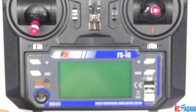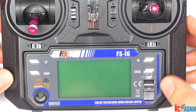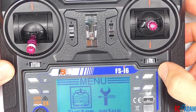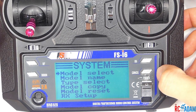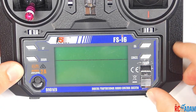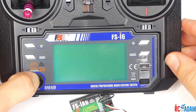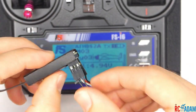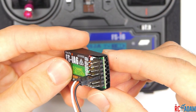With our receiver powered on and in bind mode, we go to our transmitter — this is the i6 model, and this will be the same for the i6x model as well. Power it on with all the switches in the up position. If you need to create a new model, press and hold OK to go into the menu, press OK again, then OK again for model select, select whichever model you want, press and hold Cancel to select it, then press Cancel to go back to the main screen. Now turn the transmitter off, then press and hold the bind key as you power it on — you'll see it says 'RX binding' and then 'binding OK,' and you'll see a slower flashing red light. Then unplug the bind cable and it goes to a steady red LED.